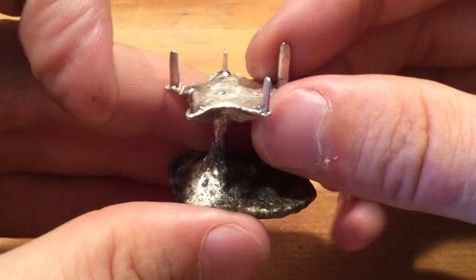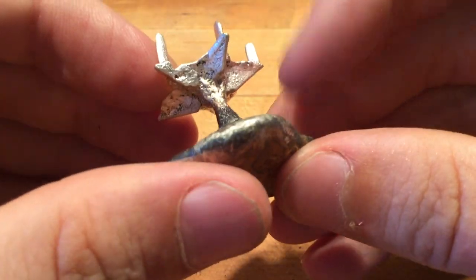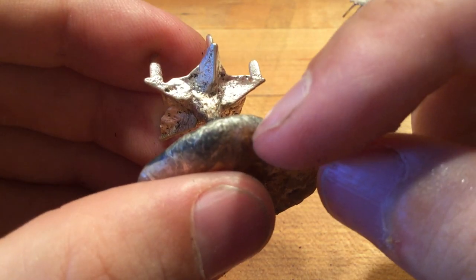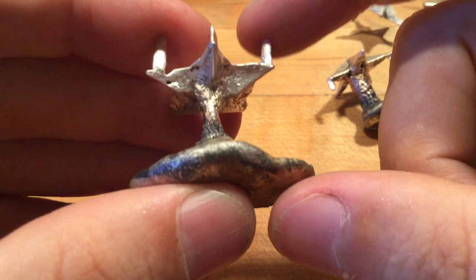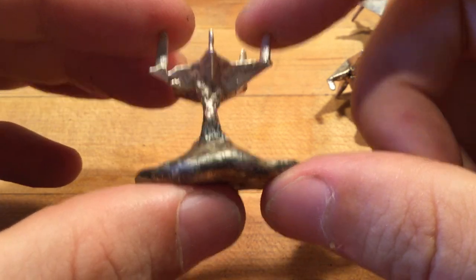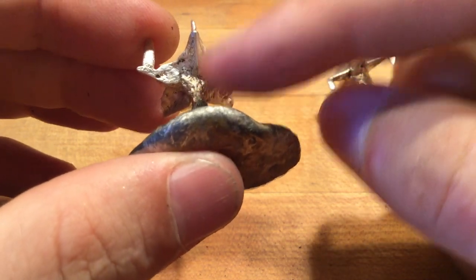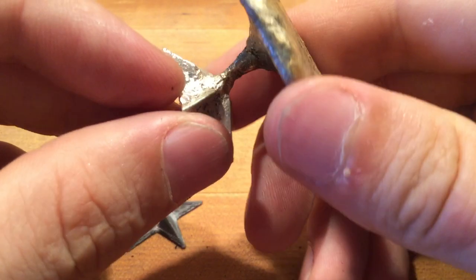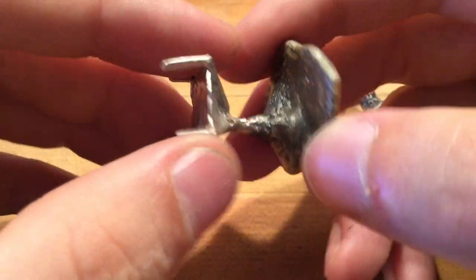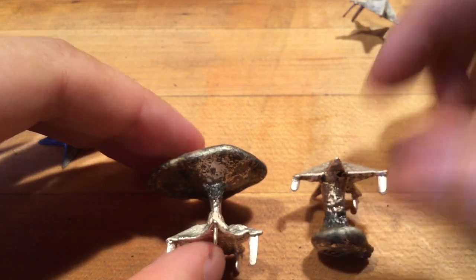You can tell we had a good cast because all 5 of our vents flowed. But then there was some fluid dynamics that were detrimental to the part as the metal went in. So we know that our casting temperature was good, our pour time was good, but the flow dynamics of the metal going into the part destroyed some of the part in its cooling and its forming and its casting. So we may try that again, but this is the 3 versions that we're looking at